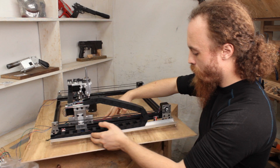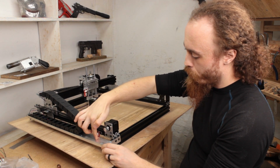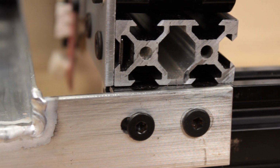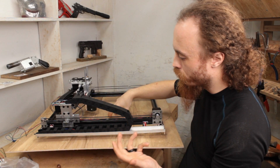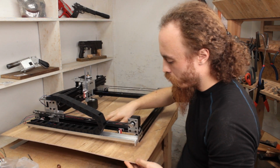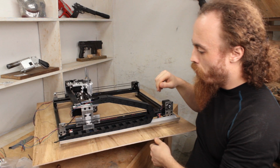And this one, obviously, I made this whole entire channel from a piece of aluminum angle that I just cut in half and then tacked together, and then welded some quick brackets to that screw right into the end pieces here, each side of there. It's again super straightforward, but keeps all of this weight in line and nice and clean and running, so it worked out well.